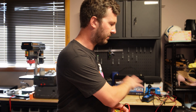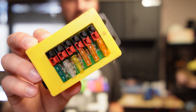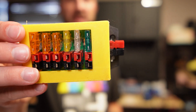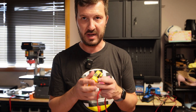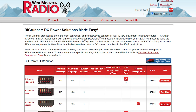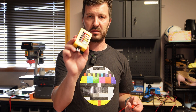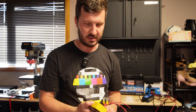Before I get into the other stuff, I wanted to show this — an Anderson PowerPole distribution block. This comes as a kit from a club in New South Wales here in VK2. I think it's the Waverly Amateur Radio Club. I'll put a link below if you want to get one of these kits. They've got blade fuses, a voltage display, and you can put different fuse ratings and Anderson PowerPoles in. It's a cheap distribution block you can put together yourself. You can also buy commercial versions like the Rig Runner from Amazon or AliExpress. It's essential if you're running a lot of pieces of equipment.